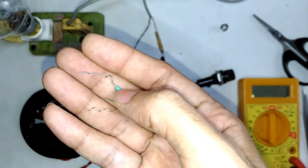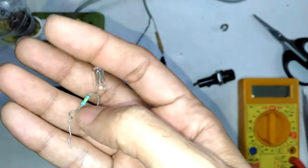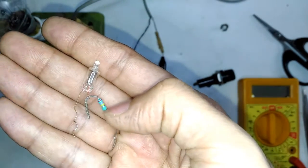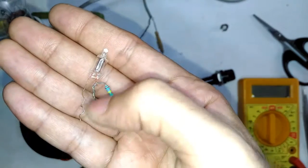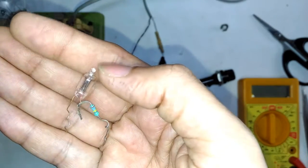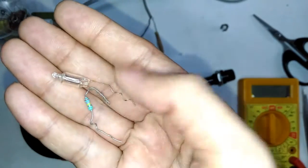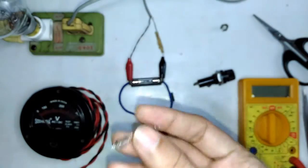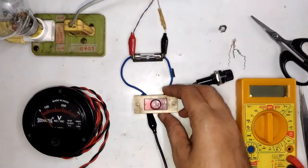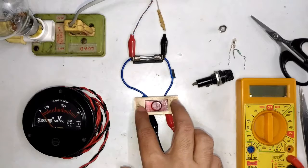The price is around one rupee, and the resistor is almost salvageable from other components. If you want to purchase one, I recommend any value higher than 100k but not above 560k — above that will obviously bring down the brightness. Similarly, any resistor below 100k will increase brightness so much that the bulb's life will significantly reduce. I don't recommend using any value below 100k if you're going with discrete components.